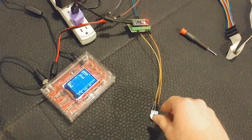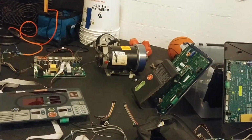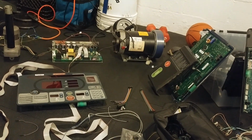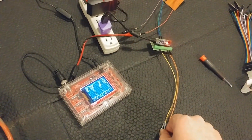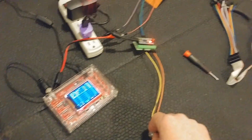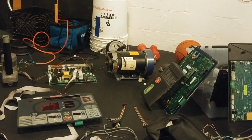So check this out. If I turn this knob and get a pulse wave coming from that Arduino, I can make that motor over there spin. And then adjust it either faster or slower, or crank it up to some pretty crazy speeds. About 5,000 RPM when I checked it with the little tachometer thing.